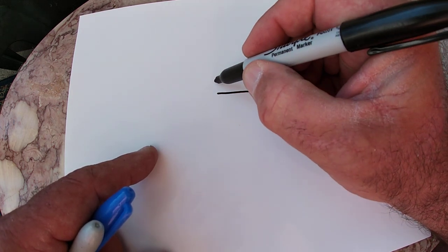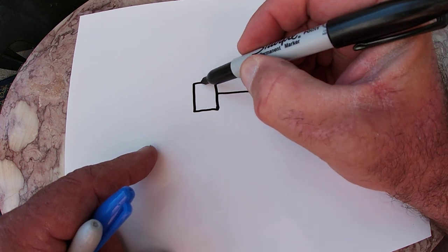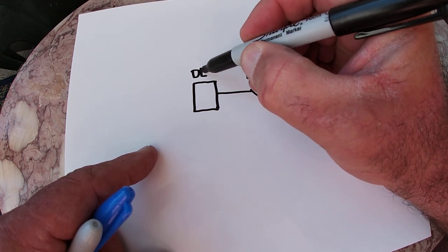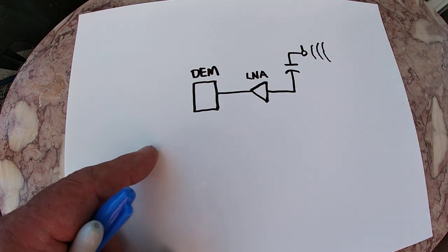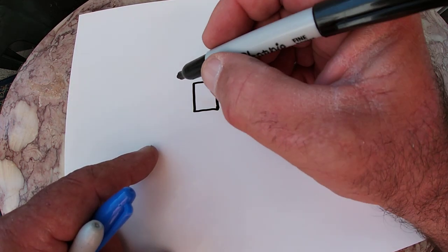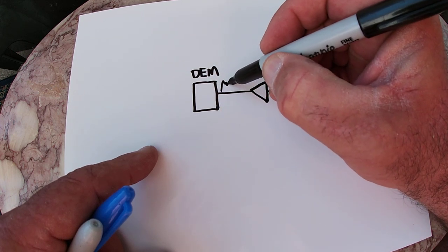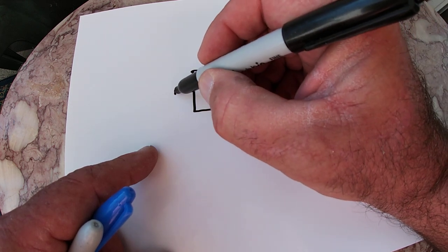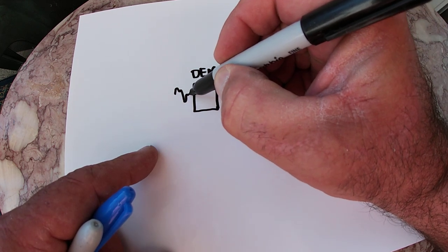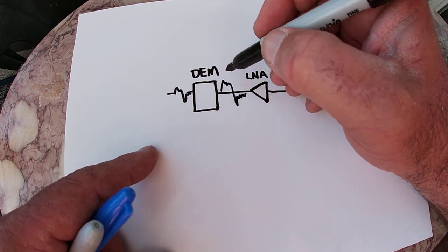And basically what's going to happen then, you're going to go into a demodulator. And that demod is going to just look at the varying parts of that carrier, of that signal, and it's going to decode it — that RF carrier that's varying in frequency and phase — it's going to decode it into just a straight analog signal down here in the voltage range, and not so much in the frequency range.